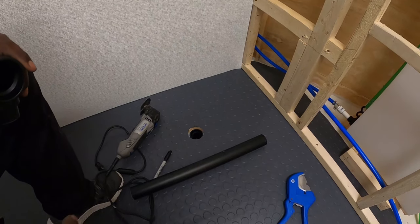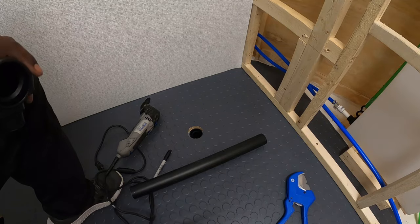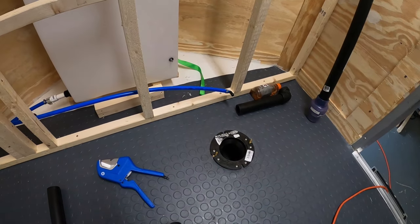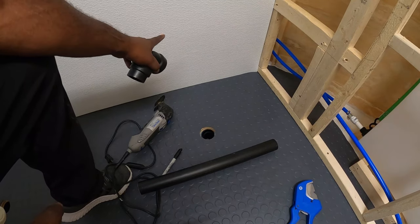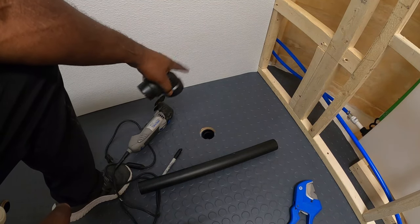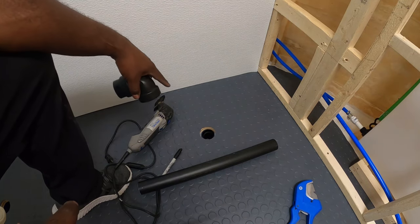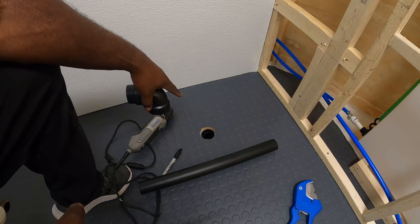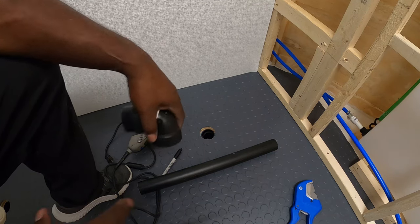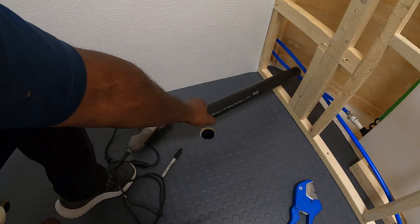If you haven't caught previous videos, this wasn't the original placement of the black tank, but I had to move the toilet, which is now over here. The shower pan is going to be right here, and I couldn't vent into the wall because of the way the beams are underneath the trailer, the beams that go to the trailer tongue. Without cutting through them, which I'm not going to do with a 2-inch pipe, my only solution was to come up through the floor underneath the shower pan, go through this wall here,